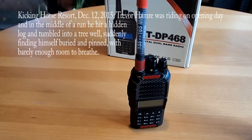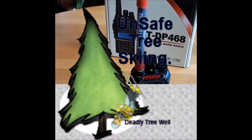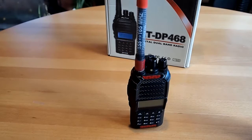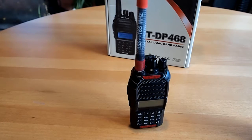Well, what we found when we're in digital was that a few times the message was all in Chinese characters, but then you could reboot and quite often figure out a way to keep it consistently sending the message out in English. However, the problem was the timeout screen: the maximum time you can get on a timeout for any one screen is 30 seconds. And you have to scroll from one screen to the next screen in order to get the GPS coordinates.